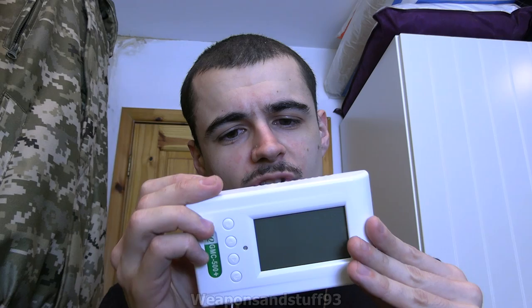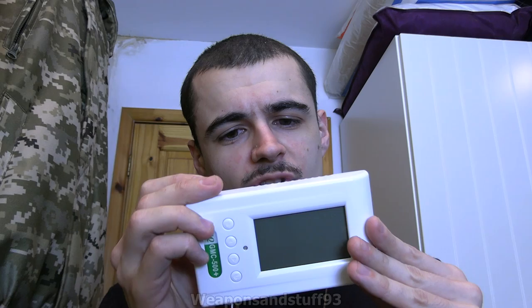It's important to note that I believe this has two Geiger-Muller tubes. If you look there, I'm pretty sure that's one there, and there's definitely another one there. I'm pretty sure it has a Soviet high-range tube in it, and what I would assume would be either a Chinese or Soviet low-range tube. It probably has an SBM-20 equivalent tube for lower ranges, and for higher radiation ranges it probably uses the SI-3BG — the little glass ones. Geiger counters that use one tube for one range and another tube for another range often work better.